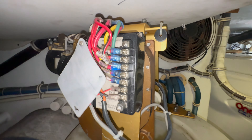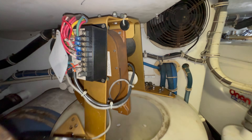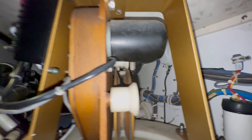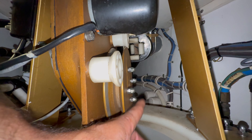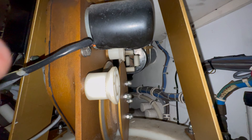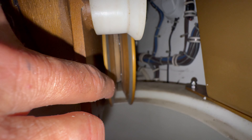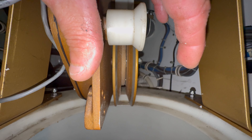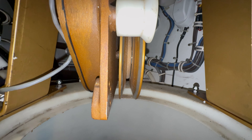After removing the cable, you can see that all the rollers, the relay, and the installation are in very good shape for the age. What we're gonna do is put the new cable in and adjust the tension with this pulley here by either adding or subtracting these shims. In order to do that, you have to pull this front plate off and if you look inside there are shims — that's what keeps the plate either squeezed or open. It all depends on the size of the cable, so we're gonna determine the correct size for the new cable going in.